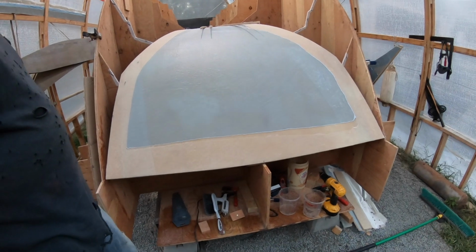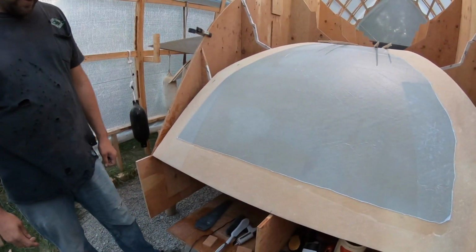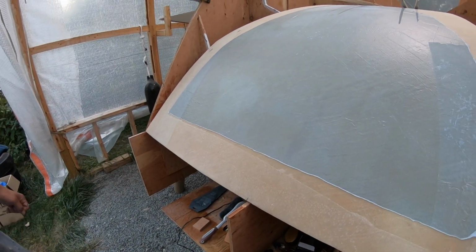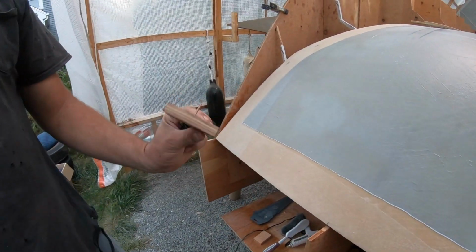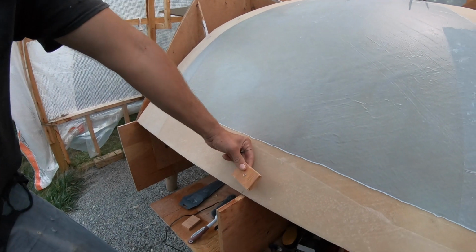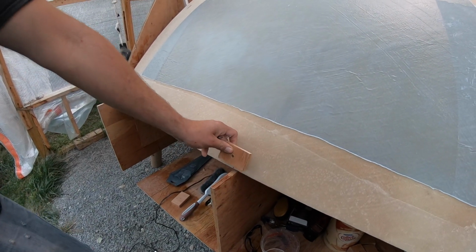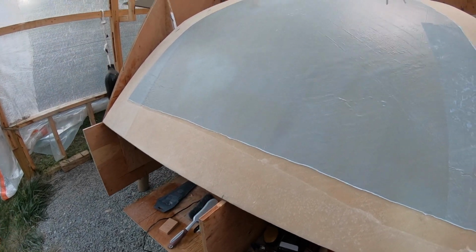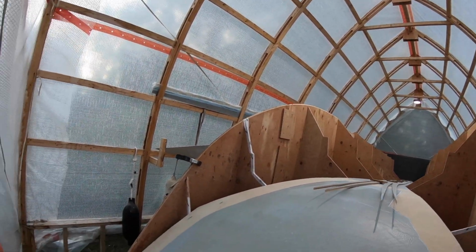We're drilling our first holes in our panels. And it's scary. It's nerve-wracking. Alright, so we have to put a washer. We made washers out of pieces of plywood. And what we're going to do is screw it to the forms. So I'm going to pre-drill the holes in the panels, and we have to hit the 5/8 ply. 5/8 ply, all the way down. That'll push everything tight against the panel, and then we can start fitting the rest of the pieces.